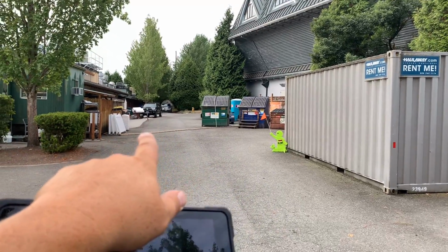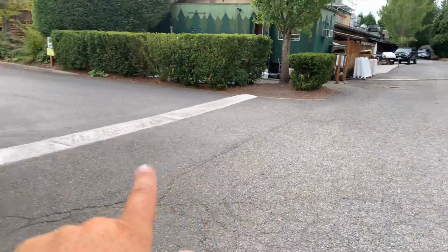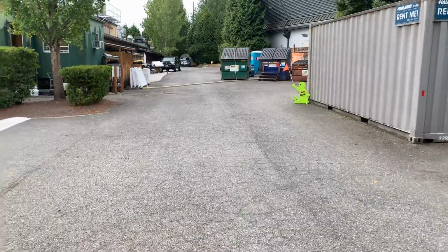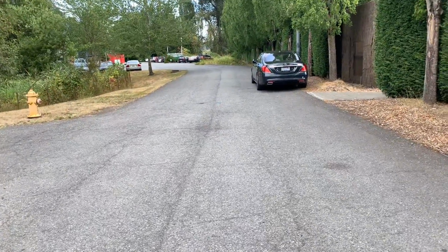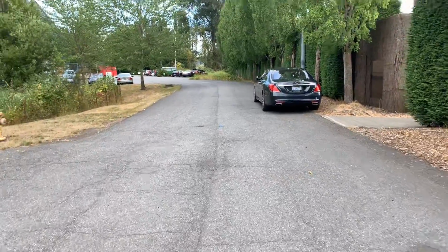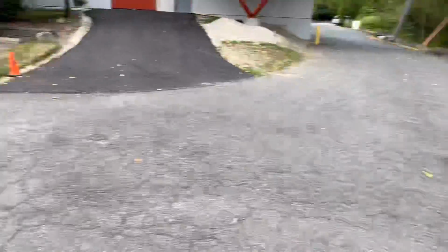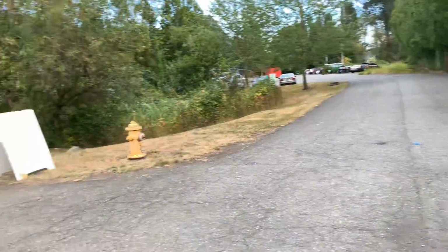But this whole area in here, straight line shot from the concrete across this and over to here, would be our boundary line for a full depth grind and overlay. We're thinking 3 inches on that, 3-inch grind and placement. We'd have to put one blue hydrant marker here, and we'll have to replace one blue hydrant marker down there for the fire hydrants.